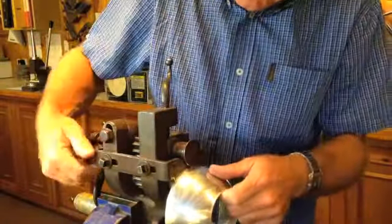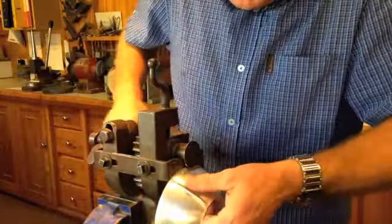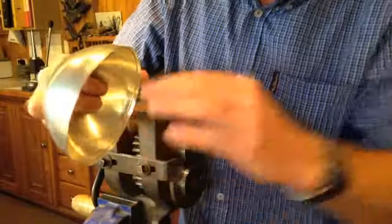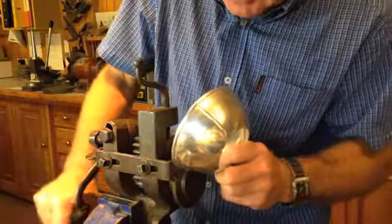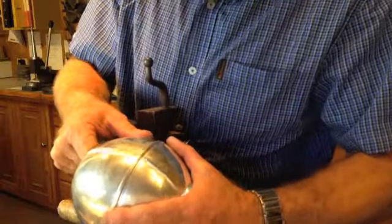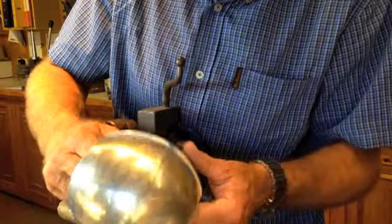Just watch this a little bit — adjust these for the thickness that I require. Pull that down so that the metal is just biting. Turn this around to start with very slowly just to get it so that it goes around accurately. I'll open that up — you can just see what we've done here. So I'll then put the Jenny inside and the metal will then come up and backwards like that. These tools were used again by all my family — my uncle, my grandfather and my father. You can't really buy these sort of tools now; one would say that they're all tin-smithing tools. You can see now the two sections will fit together absolutely perfect. I'll just use a bottom stake now — a little tool that'll go inside — and I can tap around to get this a real tight fit to join the two sections together correctly.